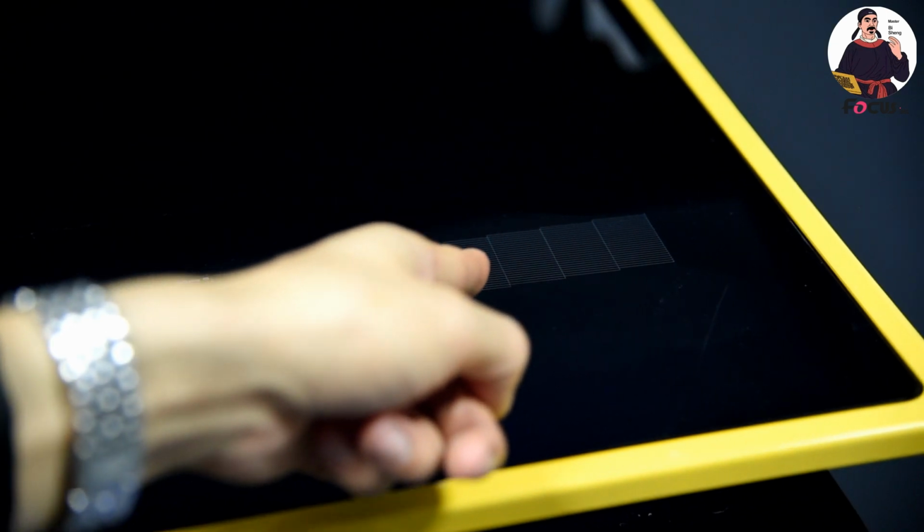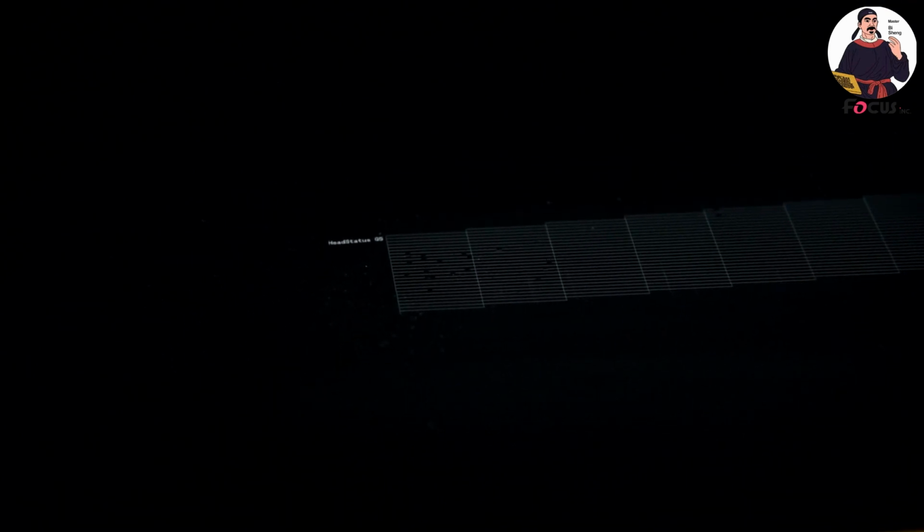Okay, after printing, we can see all the color channels are coming out. In total there are 8 channels: 1, 2, 3, 4, 5, 6, 7, 8, and you can see just a little bit of ink not coming out. So we get 99% of the ink coming out after we load the ink. If you cannot get a good result like this, you need to do the head cleaning again to be sure you get the white ink print head coming out well.